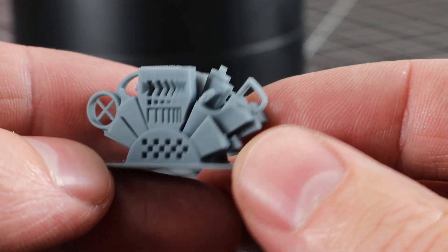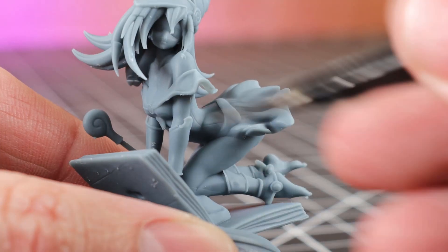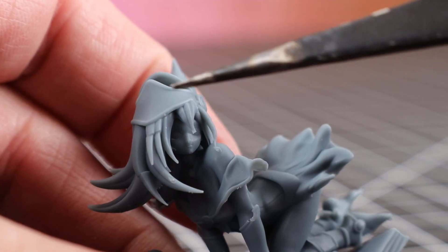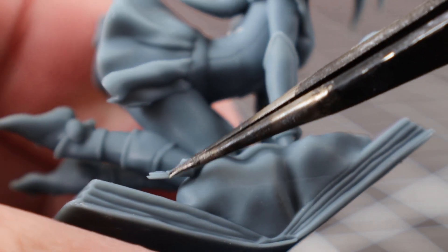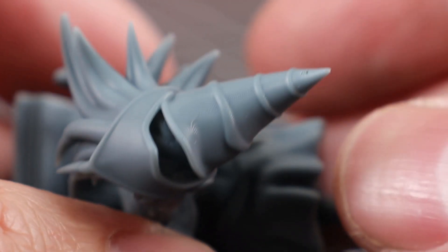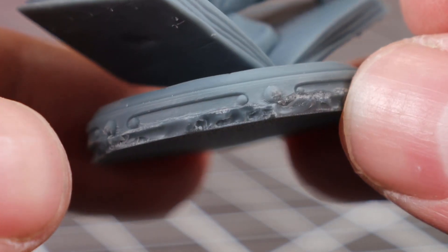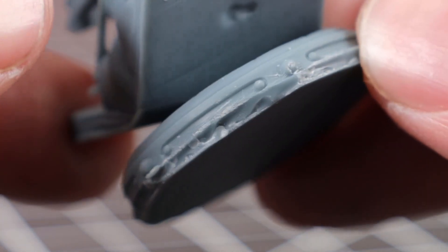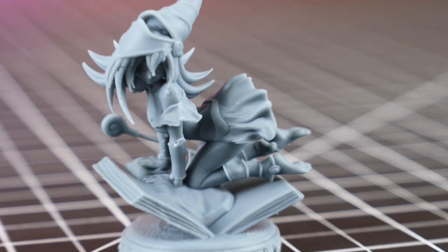Let's see how it does printing a model with a bunch of details, like this miniature of Dark Magician Girl. As you can see, it printed out fine, but I need to remove all these supports. Here we go with all of the supports removed. I did break this spot here removing the supports, and in the hair you can see a slight layer shift due to it not being supported properly. There's also a weird hole in the top of the hat, and it looks like I forgot to add supports to the hair right here, along with underneath the bottom part of the staff. This was printed at 0.05mm layer height, so there are going to be a little bit of layer lines at the top of the hat. The base was connected to the supports on the build plate, so taking them off kind of ruined the bottom area. All in all, this came out pretty good, and a lot of the problems are all my errors that can be fixed by printing it again.